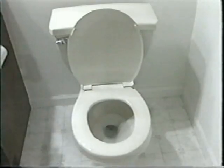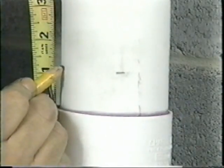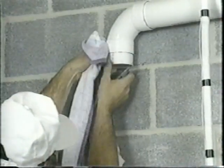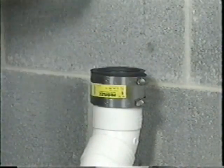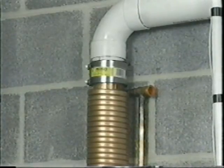Turn off the main water supply. Remind all occupants within the building not to flush toilets or drain water from tubs or sinks until the installation is complete. It's a good idea to flush all toilets once the water is off to avoid an accidental flushing. Measure and cut a section of the vertical drain pipe that is the same measurement as the GFX model you are installing, allowing an additional half-inch for fitting. Install two 3-inch no-hub connectors to the drain pipe, top and bottom. Insert the GFX into the connectors and tighten the four screw latch straps that hold it in place.